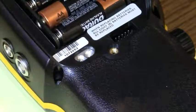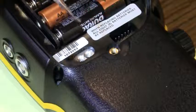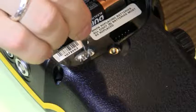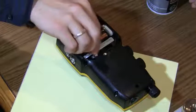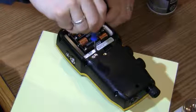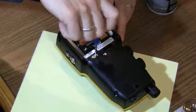Once all the parts are clean and in good order, place the o-ring and spring assembly in the valve body. Be sure the spring is properly seated on the valve body. Reinstall the valve caps and tighten gently — you will encounter some compression from the o-rings, but the caps must be tightened until they stop. Do not over-tighten.